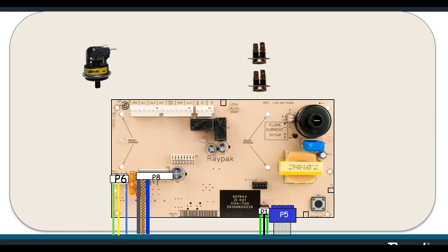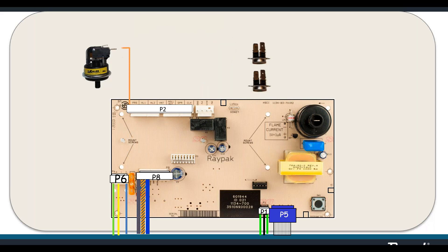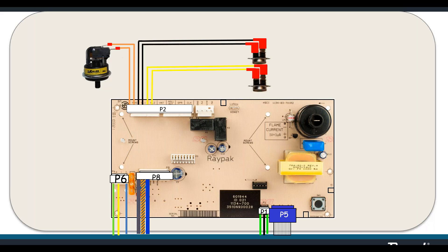Each pair of pins sends 24 volts out and 24 volts back — the board is simply looking to make sure that circuit is closed. Any open circuit disables the heater. Some pins complete the circuit by looping a wire back on itself. The rollout sensor works the same way — 24 volts out and back. The pilot assembly plugs into the black connector, which is a 24,000-volt coil producing our spark for ignition. Four wires go to the gas valve from P4: ground, PVMV neutral, PV for pilot valve, and MV for main valve.